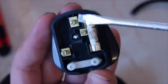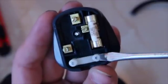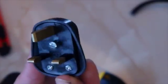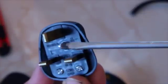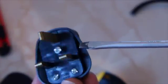The three connections are the neutral, the live, and the earth. There is a strain relief here as well. Turned over you can see the pins — you have got a live pin marked with an L, the neutral marked with an N, and then the earth pin which is the longest pin at the top, marked with the earth symbol. The earth symbol is the dashed lines with one line coming out the top.